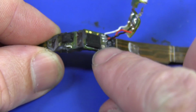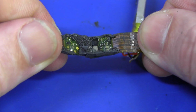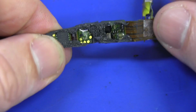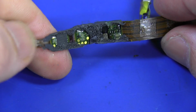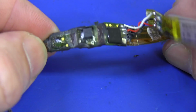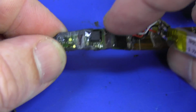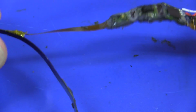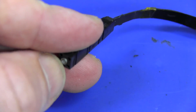And then we've got our main processor board here with the MSP 430 processor. Once again, that's double-sided load, so that'll have some voltage regulation and other support stuff on it. Looks like we've got some test pads there for production testing. And then, yeah, we've got another couple of chips around there, which we'll have to have a look at. That one and that one down in there with the test pads, and then that goes all the way down to that programming / test tactile switch interface.